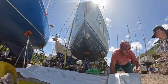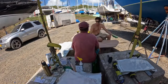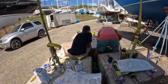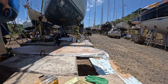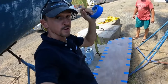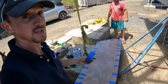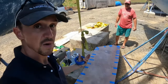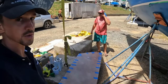I've got Jay with me and together we're going to start prepping this. I'm going to do this process with the fiberglass and peel ply four times, so don't worry about me explaining all of it here on the first one. The important thing to know is you only have a little bit of time, so you want to get all your prep work done ahead of time. When you do go to put everything on, you're only going to let it dry a little bit — you're going to remove the peel ply before it's fully dry, and that way you don't have to sand it before you put on the next layer of epoxy.